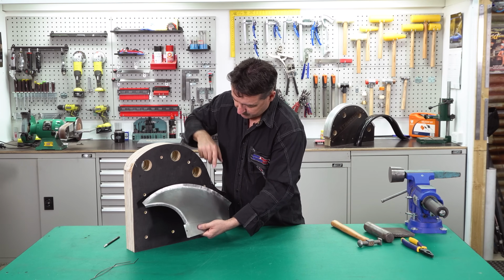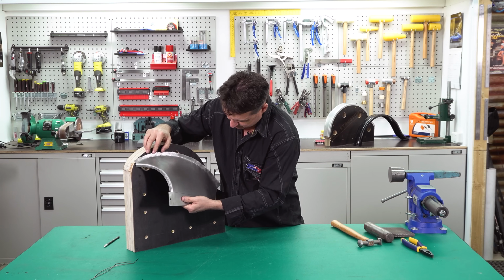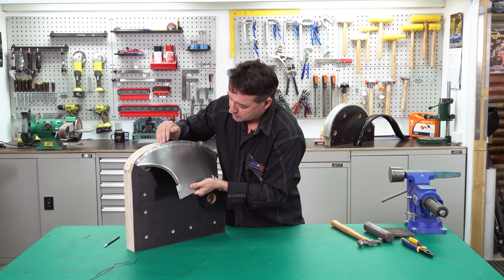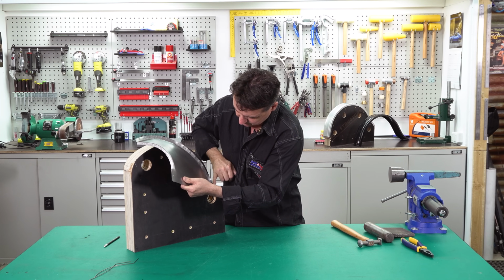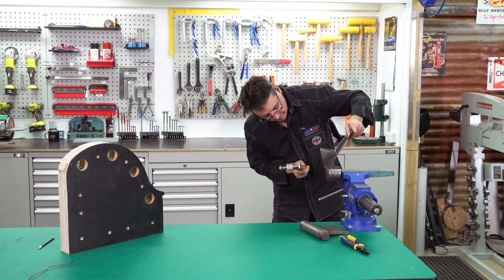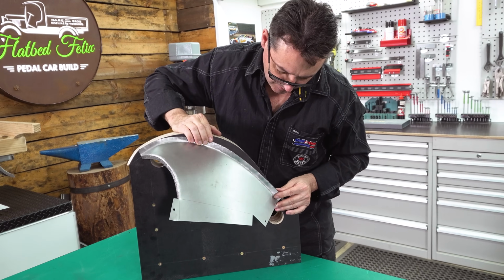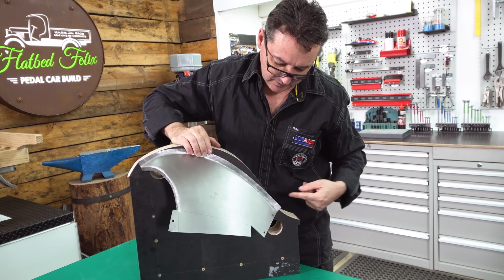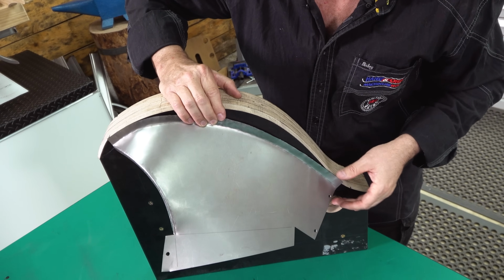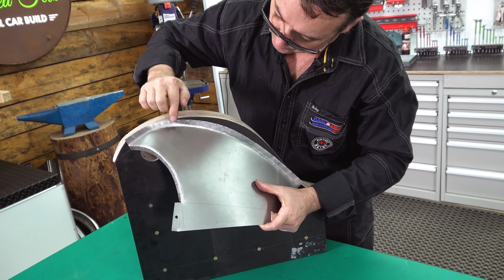We've got our reference points marked on our forming buck. I can begin the process of lineal stretching through the top flange. We keep referencing at the same point. You can see here there's quite a lot of stretching to do. So start at the front, stretching through here until the back meets down here. We're heading in the right direction, so from this plane here you can see that it's all started to tighten up. However, a lot more stretching is required through this radius here. Front is good, the back is not far off, predominantly stretching through this area.